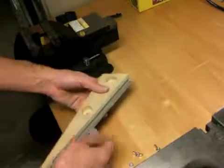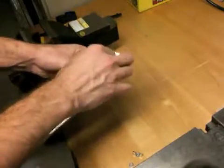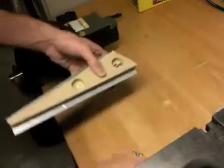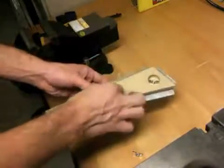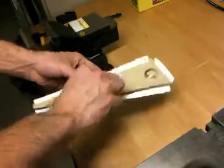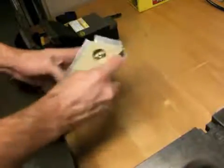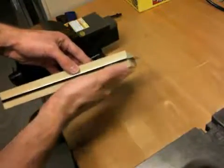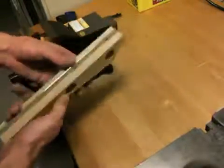Anyway, you flip this guy over, and you put a little washer on there, a little bolt, and wing nut. I figured this is just easy. I don't have to use another tool. I can hand tighten it pretty darn tight, at least enough for the purpose of bending these flanges over. The whole point is that if you look at it from this direction, the wing nuts are below the surface on both sides, so it makes it really easy to hammer down.